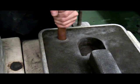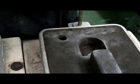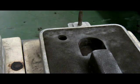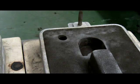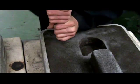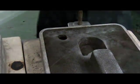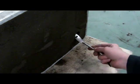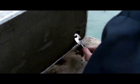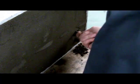Now we need to drill a hole through from the inside of the casting to the top — this is where the molten material will be introduced. You then flip it over and cut a taper on the top, which is called a pour cup, which makes it a little wider so the molten material can be introduced a little easier. Then the two halves of the flask will go back together and it's ready to have the molten material introduced.